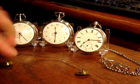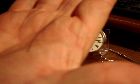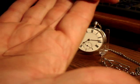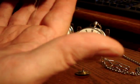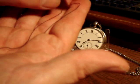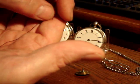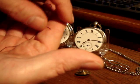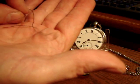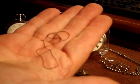What's unique about these watches is the chain — this little piece of chain. It's almost like a little bicycle chain; it has individual links and rivets. There were people that made these chains, and that's all that they did. These are all handmade — each little rivet was actually filed out of a piece of steel and the rivet put through. It's got little tiny hooks on the end of each chain; these hooks are what connect it to the barrel and into that Fusee cone. A unique technology that was used for nearly 400 years in watches and clocks.